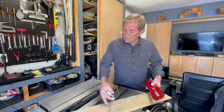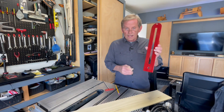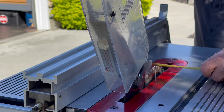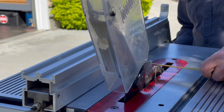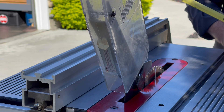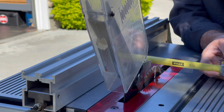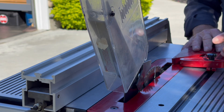The inserts are fifteen and seven-eighths inches long by exactly three inches wide. I'm going to start out by just ripping this poplar three inches wide, then trace out my blanks using the insert as a template. These dimensions have to be dead on. Anytime I have to have something really fine as far as ripping, I'll always set my fence up a little proud and then use one of the lesser-known features of the ShopSmith — fine-tuning using the quill feed. I can get my dimension set perfect just by moving that quill locker in place. I also always use my feather board on this kind of work.